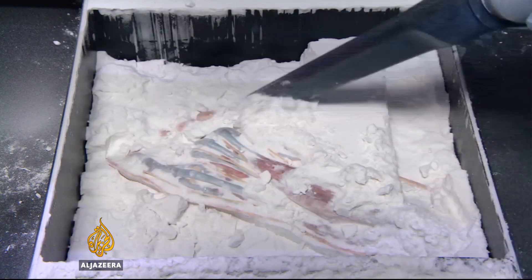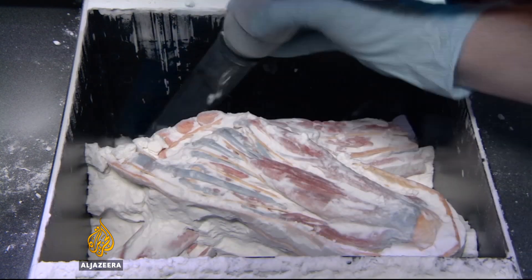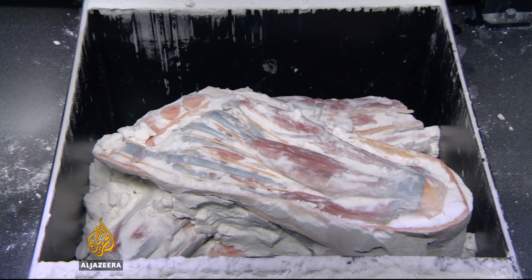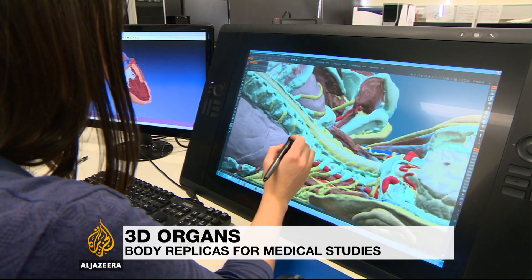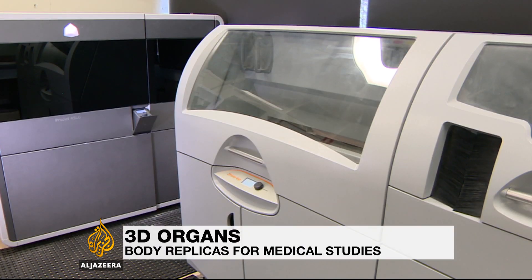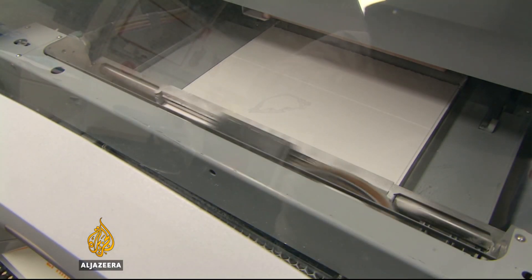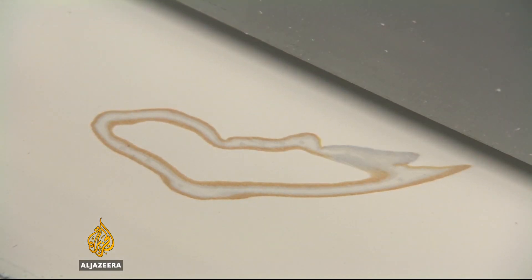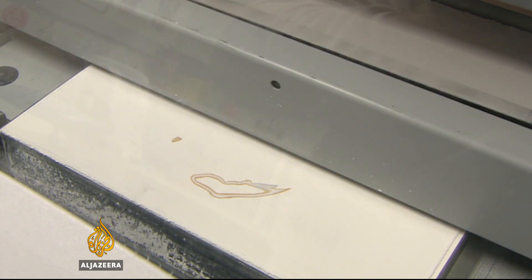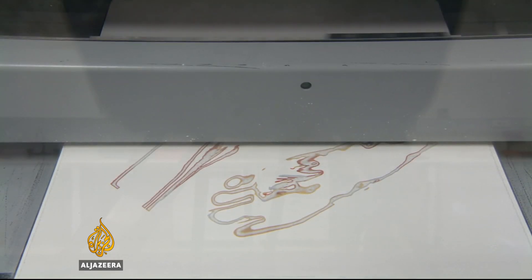Caked in this powder is the latest innovation in 3D printing: replica body parts. Designs are based on CT scans of people, which are coloured within a computer to create a file to send to a 3D printer. It builds a block of powder in thousands of incremental sweeps. With each sweep, the printer head injects solidifying colours into just a tiny proportion of the powder. As the block is lowered a tenth of a millimetre for each sweep, a detailed limb forms within.